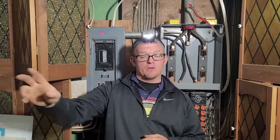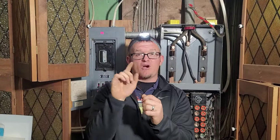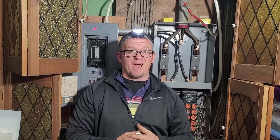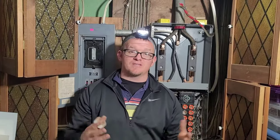You likely could go to that receptacle, but always put it back the way you found it, and then when you turn it back on, you have to go find and correct it before you leave it energized. Because if you took the white hot and hooked it to the neutral, and the black hot to what you'd think would be the hot, it could fry a piece of equipment on the other side or cause a dangerous situation, depending on what was done on the other side of the circuit.